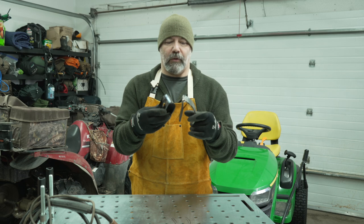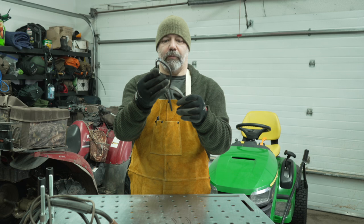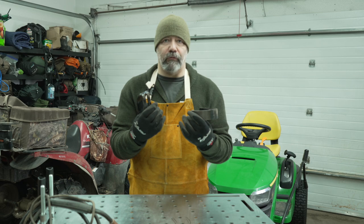No problems at all. I welded up that pad on this one, and I'm just going to keep an eye on see how this one wears, and then I'll probably just overlay the same or maybe chop a piece of this 3/16 and just weld a pad on there that I can replace. I'm just going to spray a bit of paint on to stop it corroding the exposed parts, but the bottom's going to get obviously worn away anyway, and then we'll reinstall them back on the machine.